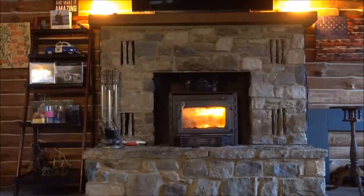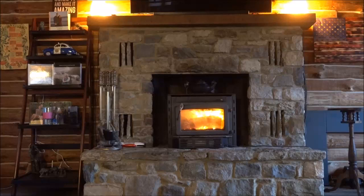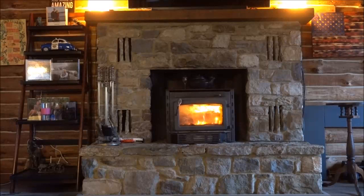Once it heats up, what we do is we turn the upstairs fan on, which will draw the air from the upstairs, cycle it through the basement, and then back out the middle level of the house. We have an incredibly efficient, brand new, basically house fan system. It uses, I think, 80 watts of electricity while it's running and circulates the air pretty well.